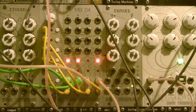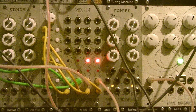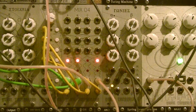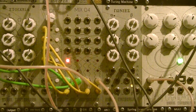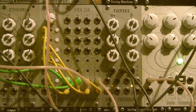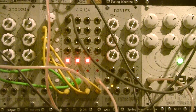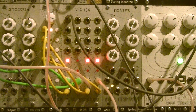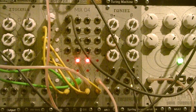To simply show you how to manually open the VCAs, I'll patch a couple of offsets. I'll take the first one and patch input one into output A, then turn the offset knob. You might not be able to see the color on the VCA output, but you can see the top LED on Tonic start blinking — until I turn the offset knob back to zero to close the VCA.